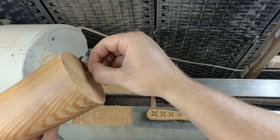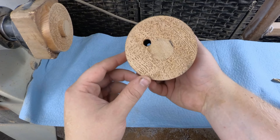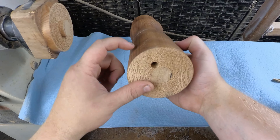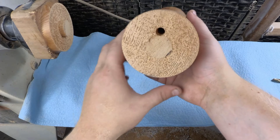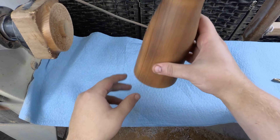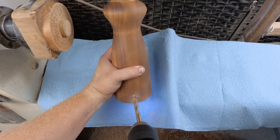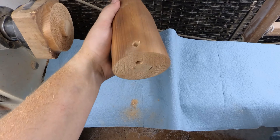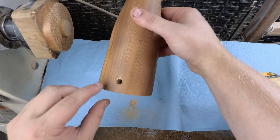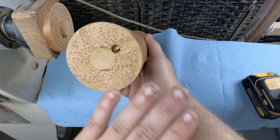The other piece of wood on the bottom is just there so when it goes through it doesn't hit the cement. All right, I got the hole — like I said, it doesn't matter on the bottom, all that matters is the top, and that is right there in the middle. Now we need to make a hole right here so that our wire can come out. You could make a little ridge through here if you have a router table so that the wire sits in the ridge and doesn't mess it up when you're trying to sit it flat, but I'm just gonna make a hole right about here. Hopefully that's big enough — if not I'll come back with a bigger drill bit. I will sand the bottom on my belt sander, get that all the way to 400 grit.